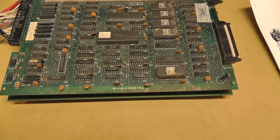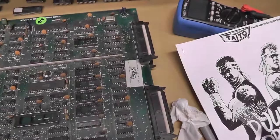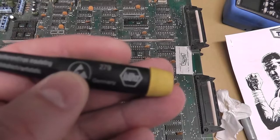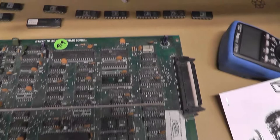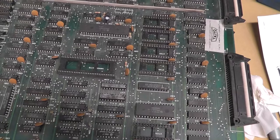Just going to remove the chips, clean the board, and then come back and set the dip switches and make sure it's right before we put it in the cabinet. I got all the chips out with my nice little chip puller — I don't know who makes it, somewhere in Germany. This is what I use for a chip puller. I definitely recommend it — it's anti-static. I labeled the chips with the IC number because it's printed on the board: IC23, 24, etc.